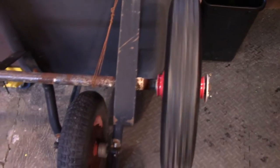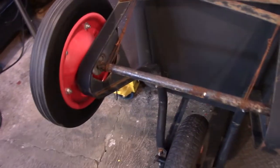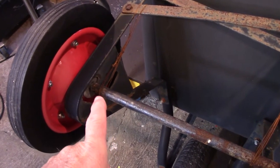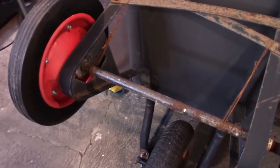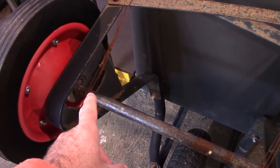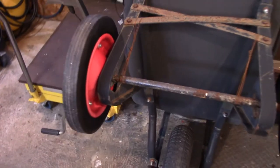I put these wheels on here and had to fabricate how to actually do it. I like solid rubber tires on the back — they've worked out terrific. Now, this mechanism I have all wired up: this wheelbarrow design has standoffs that touch the ground so the wheelbarrow is not moveable. If you have a load you don't want it rolling down a hill. I don't have many occurrences like that so I just wired it up. The design is: lift the handles and this bar drops the standoffs below the wheels — though that won't happen now since I put much bigger wheels on.